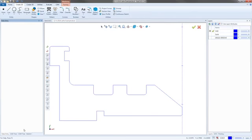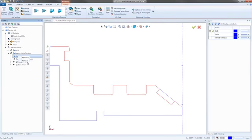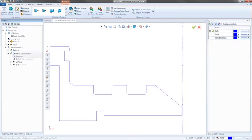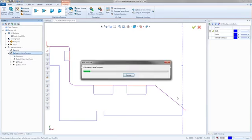So as long as I created that line properly, now if I go ahead and remove my old turn geometry and say reselect, whoops, didn't go to the end, got to go to the end of the first, or pick the first chain. Always pick anywhere on the first chain. You should be fine. Then I'm going to follow it to the end of the last chain, find the midpoint, and go past it. Then hold shift and click a second time. And again, as long as that geometry is good, it should chain all the way through there. When I'm all done, go ahead and hit OK. And then now I'm going to recompute, and we shouldn't have that groove getting cut in anymore.